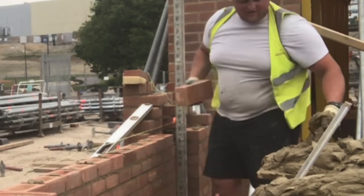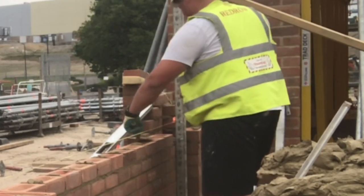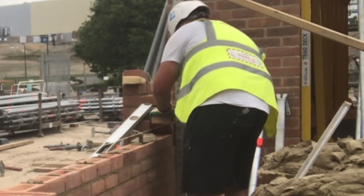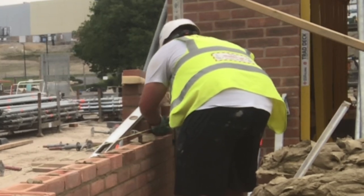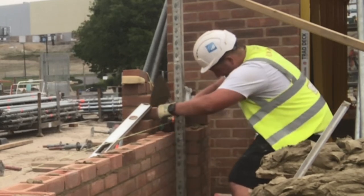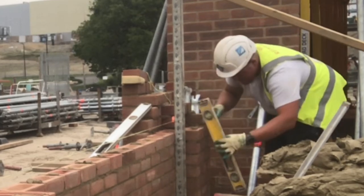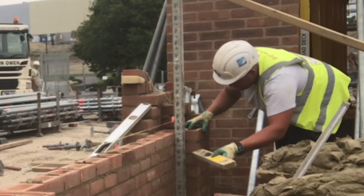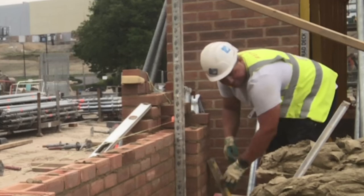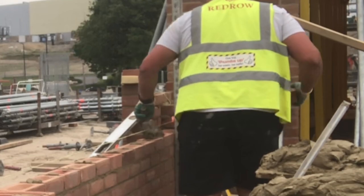As you can see, I've moved the line up and I'm just filling in the remaining bits of the pillar. In this video you can see I have a corner built at the other side — I've racked a pillar corner back at the other side. If I had four aluminiums I could take away the corner building aspect from both sides, but I don't bring four aluminiums to work. So I've racked a six-course tail-out the other side and racked the pillar back as I normally do — I've got a video coming up tomorrow of that.